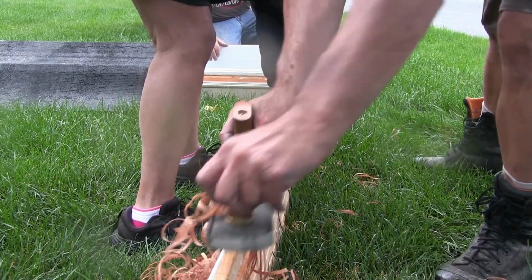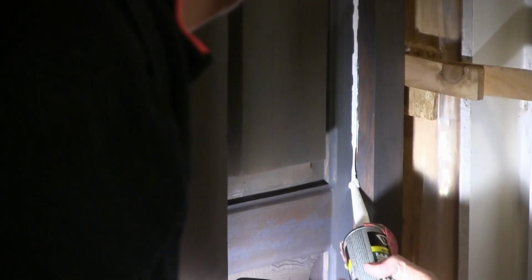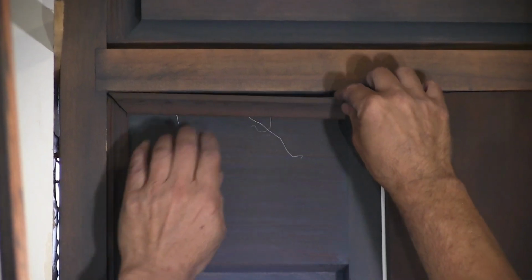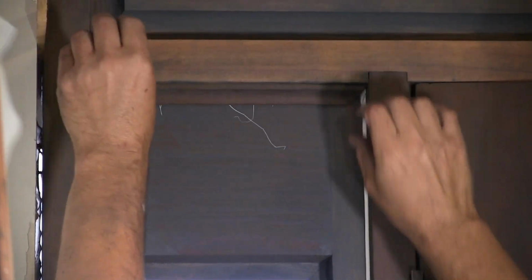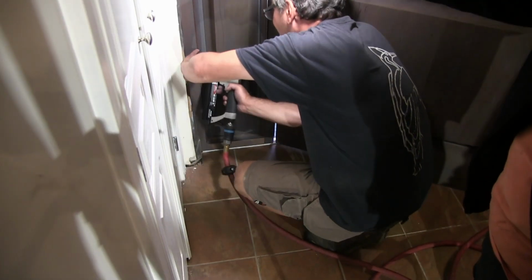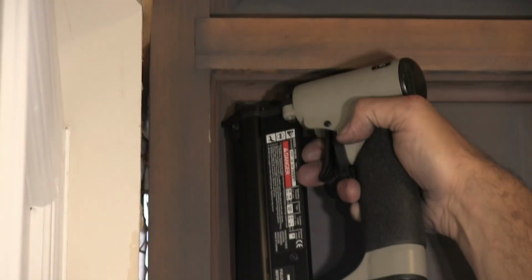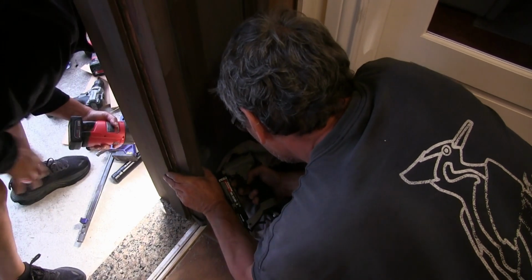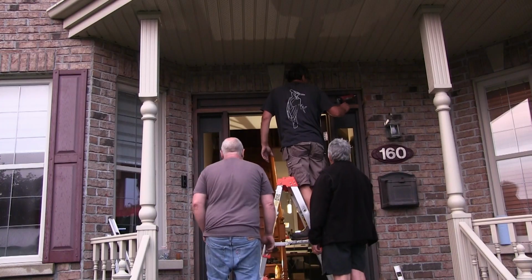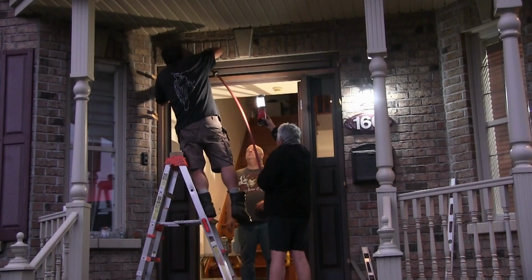With the moldings ready to be put in place, all that remains to do is spread a bead of caulking around the side lights. Lucky for me that it will be covered, because as you can see, applying caulking is not my strength. I was also lucky that the finish is still oily, because cleaning the spill I made is quite easy. Now I can nail the moldings in place. The side lights have their moldings, but the impost still has to be caulked and molded.